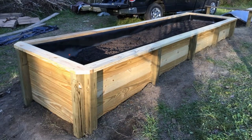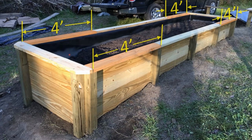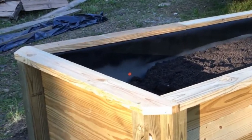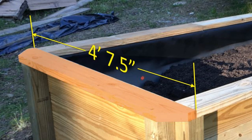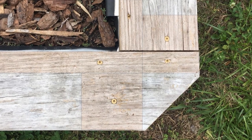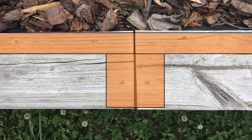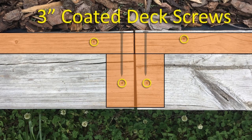A little flat black paint on top of the flashing, and it's time for the top boards. They are made from 2x6 pressure treated lumber, with 8-foot lengths in the middle to add rigidity where the sideboards meet in the middle. If I had to do it over, I'd stagger the sideboards so they didn't all join in the middle. The other side pieces are 4 feet long. The end top boards are 4 feet 7.5 inches long with the corners cut to 45 degrees. All of the top boards are attached using 3-inch deck screws. Here's a look at where the deck screws are placed on the corners, and here's how they attach where the side pieces meet, positioned to avoid hitting the screws holding the sideboards on.